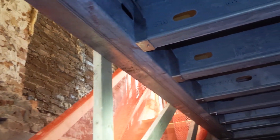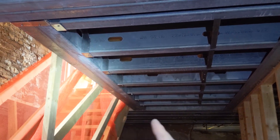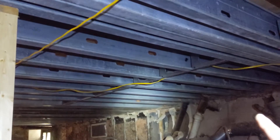Now I want to show you one more interesting thing right over here. You see next to this staircase — which is going to be a staircase further on — there's a double joist right here. This double joist is essentially back-to-back joists, or it could be created like a box. It runs all the way across and this way, and you can see how many joists it's supporting — all the way from there down to here. It's supporting a lot of this wall.